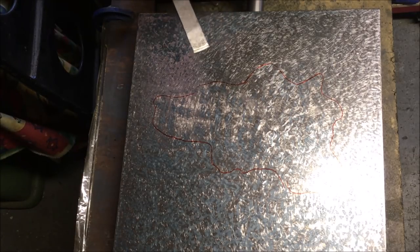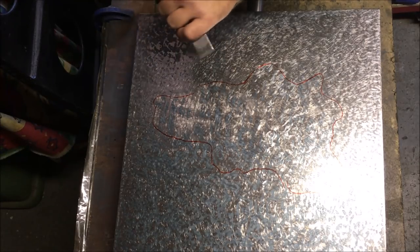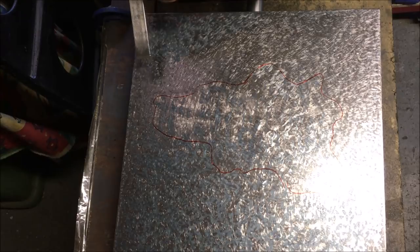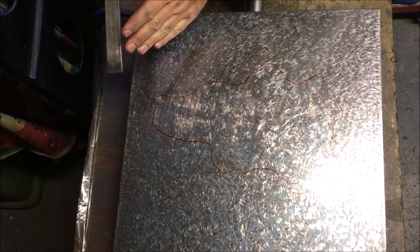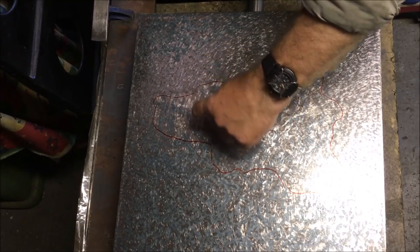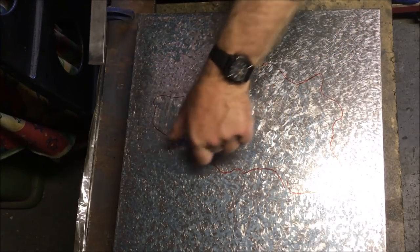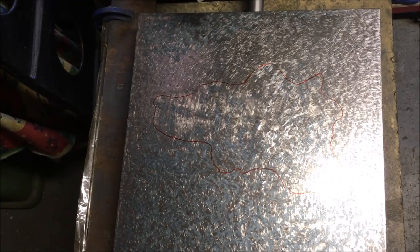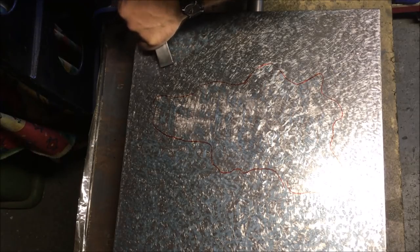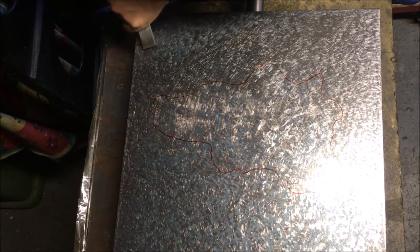Interesting to note that from what I could see, Robin Renzetti, he's right-handed, is holding the scraper in the same orientation as me, but he produces his curl that way round. So he works from left to right, the idea being that if you draw a curve that way, the next curve trims its feet off. Well, I'm working my way around, but he's working the other way around. I seem to think Chris is doing it the other way around as well, which would suggest that I've got it wrong, apart from the fact Chris is left-handed and then throws me a googly and does it with his right hand as well, leading. I don't think it matters.